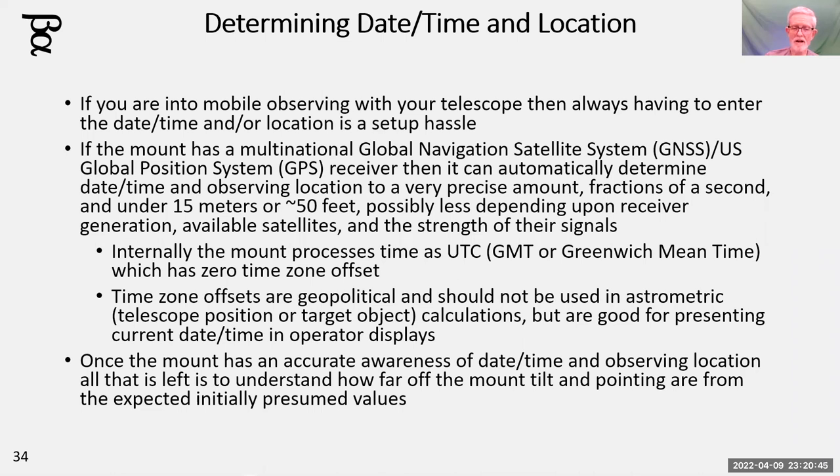So with that information, you can not only determine your location, you can determine which direction you're pointing, because you know which satellites are going to be gaining signal as they come up and which satellites are going to be losing signal as they go away. And based upon the signal to noise ratio of those changing, you know which direction your receiver is pointing. It's kind of cool. They didn't have to add anything for that. They just went, what if we made the software smarter? Now that we can have 16 satellites to work from and we've got all the orbital characteristics of them, let's just use that.